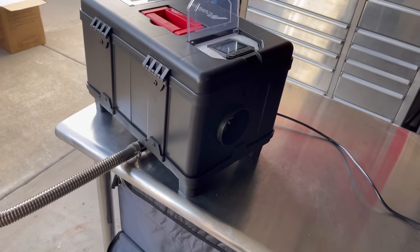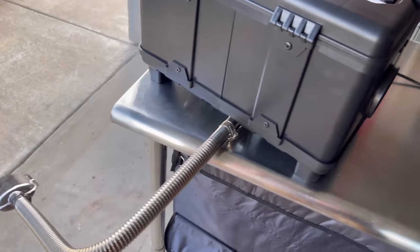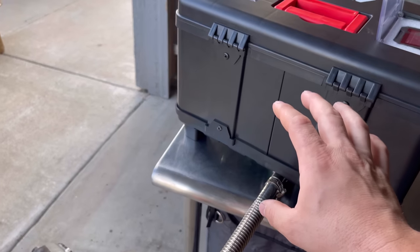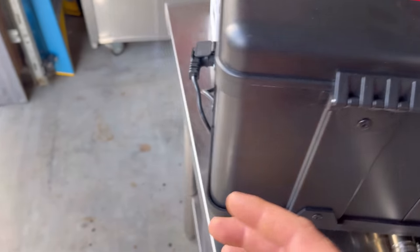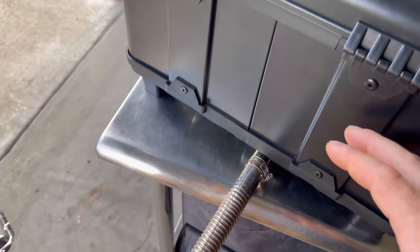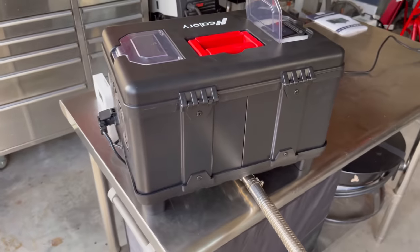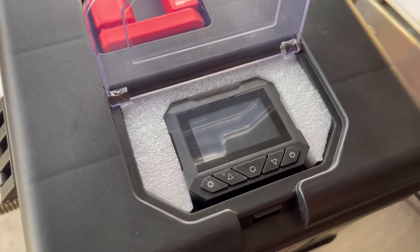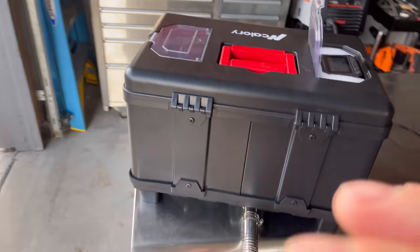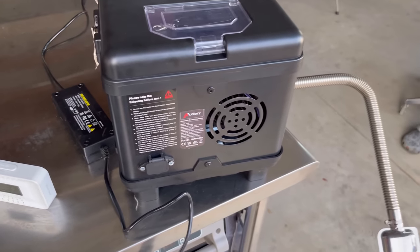It just gave us feedback that it stopped heating. This thing is going to throttle way down and it may just pick back up — what's happening is it goes through a shutdown cycle where the fuel pump turns off. The heat is still in the heat exchanger, so the fan will rev up and help reject that excess heat off the exchanger. The shutdown cycle takes somewhere around two to three minutes. Once your controller indicates it's done, you know it's okay to unplug the power supply from the unit because it's completely shut itself down and safe to unplug.